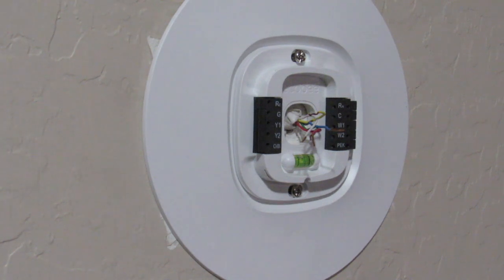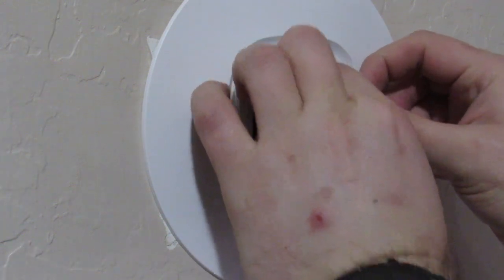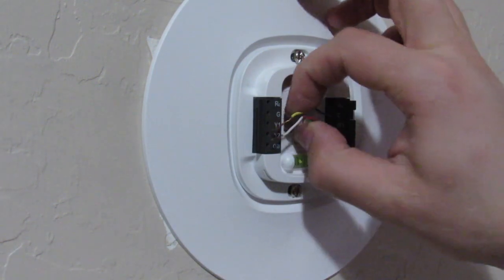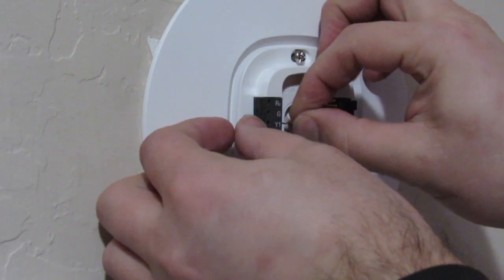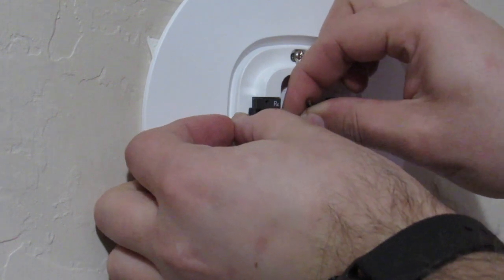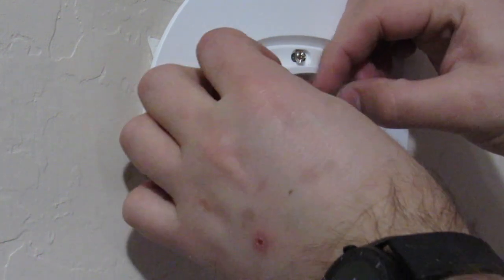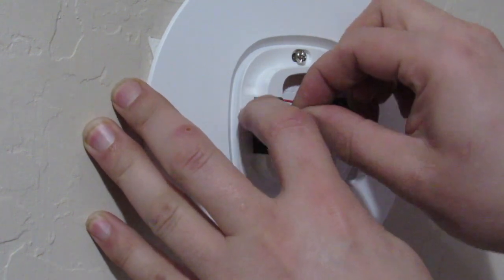Then go ahead and look at the wires to start putting them back into their appropriate connection labels. With the Ecobee mount, you have holes that are directly facing you pointing away from the wall, and then ones on the inside near where the wires are — the wires need to go into the inside holes with their corresponding letter. The thermostat itself will then plug into those outward-facing pins. If you do not have a C wire, the power supply unit would be installed in the wall behind the thermostat — we'll have a link in the description with a picture of what that looks like and the steps to connect it. Finish putting all the wires in and push them flush so they're out of the way.